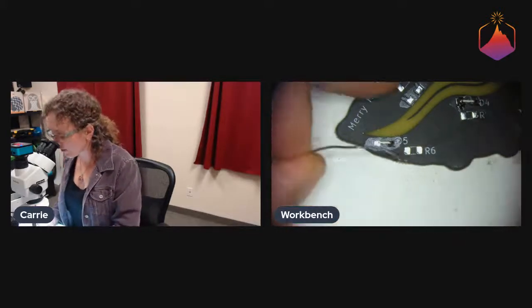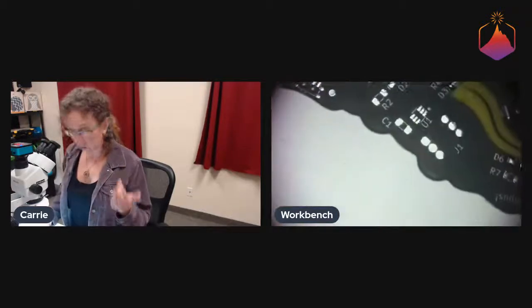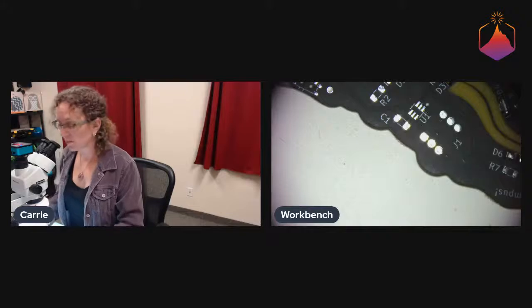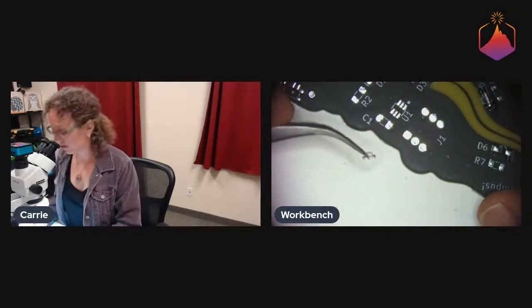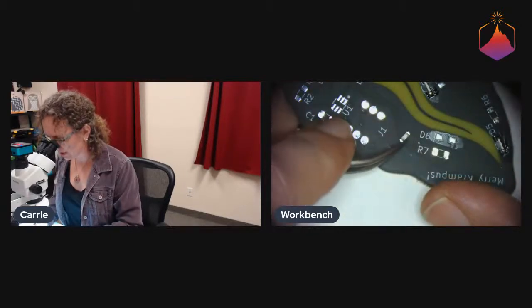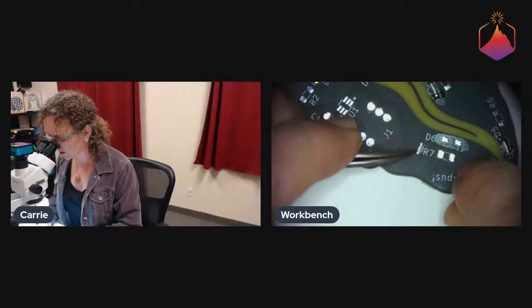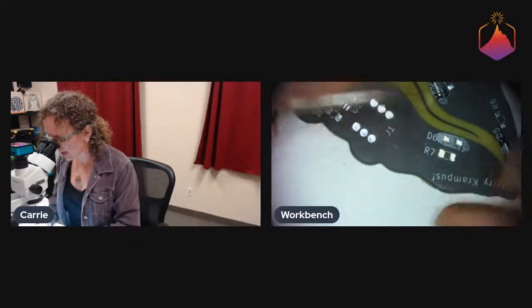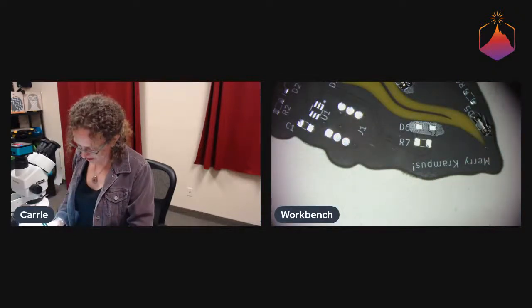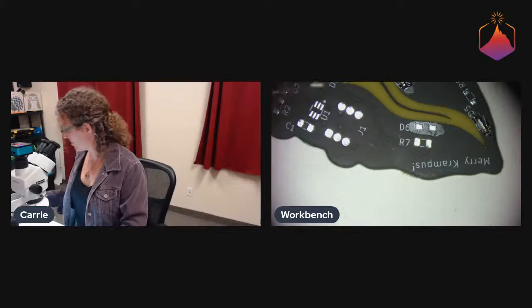And those we're assembling here ourselves because, as I mentioned, we were kind of behind the ball on this and just didn't have time to get them done out of house. And we're doing that in the reflow oven. We did some today, Robin did some, and I don't think there were any problems with the LEDs, were there? No, yeah. So they reflow super well. They stay in one spot. They're quite stable. I hear that original versions of side mount LEDs that weren't completely flat on the top and the bottom can be a pain in the ass for reflow, but these actually are pretty good. Yeah, no problems with them yet. Hopefully those are not our famous last words.